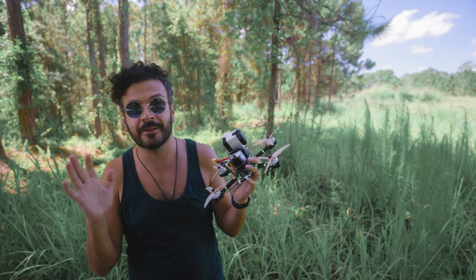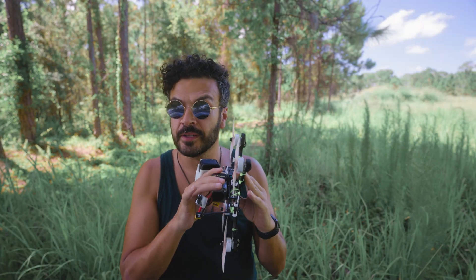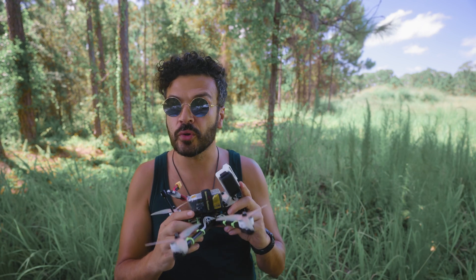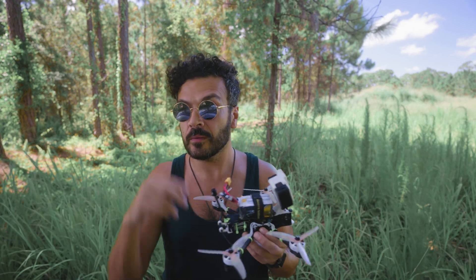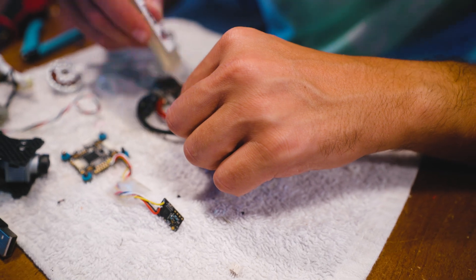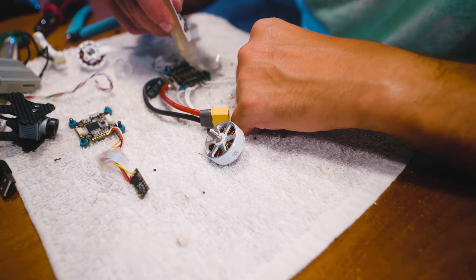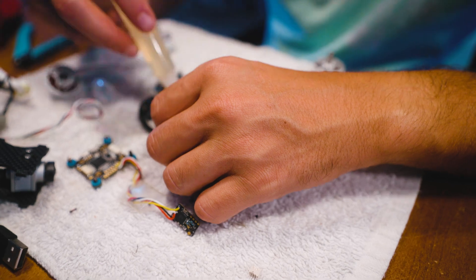All right, I'm back, I'm dry. This is the next day after that whole mishap. So a bunch of things I learned using FPV Worry-Free. The texture once it's cured — the best association I could have is like the urethane from a bouncy ball, how it becomes solid and kind of bouncy and rubbery, but you can also peel it away in little chunks. It has that type of consistency, which is good because you want it to fill the spaces so water does not flood the circuit board.